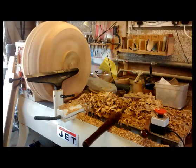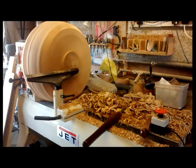Round and starting to take shape, push the speed up a bit, up to 350 RPM. Not quite so heavy, but now it's not out of balance anymore. We can afford a somewhat higher speed, not very likely to fly off now. So this is where it gets a little bit quicker to take the stuff off as the shavings fly.